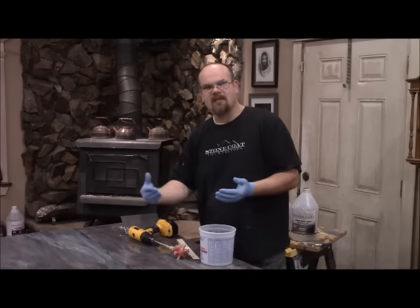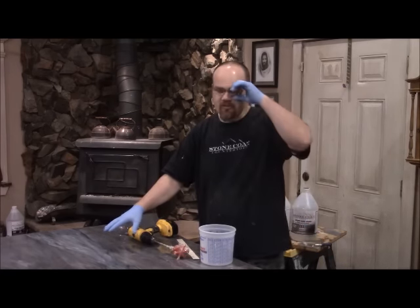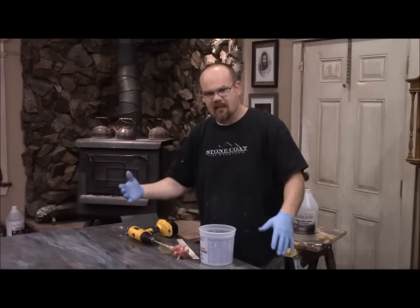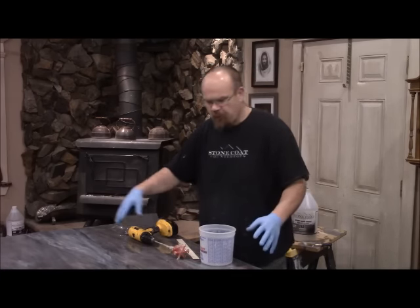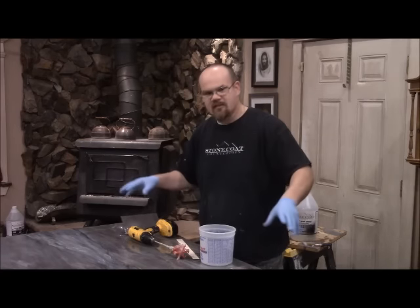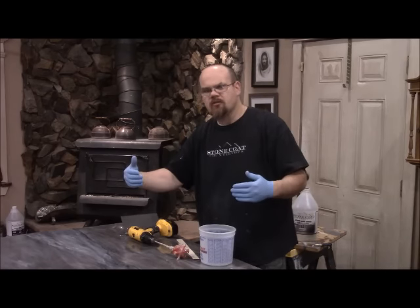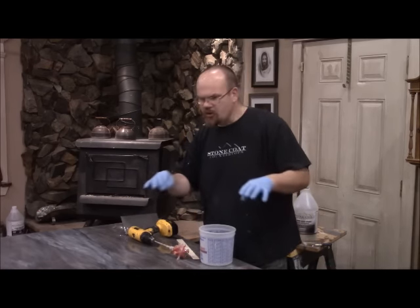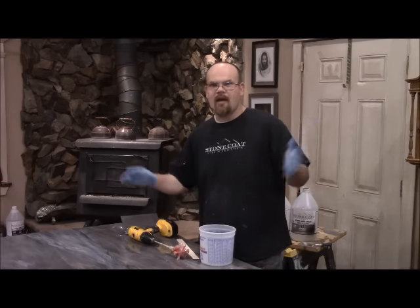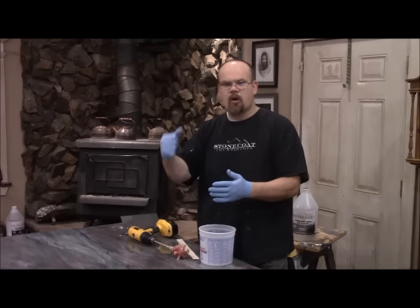I put a second flood coat on top of my decorative coat for a couple simple reasons. Number one, I want a little bit more protection and I want a little bit more thickness on my top. Also, when you put in the paints, pigments, and color effects, you're going to have a little bit of imperfections from all that artistic work. You'll feel little highs and lows depending on how late you did those decorative elements. If it started gelling at all, it may not self-level perfectly. When we put just a clear on top, we're leveling it and walking away — it has so much time to level and it protects all your colors. There's nothing else in the top but Part A and Part B.